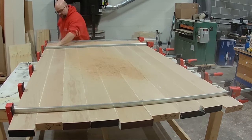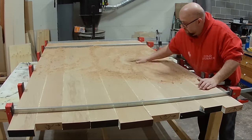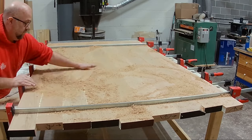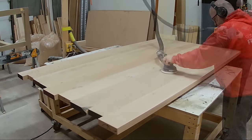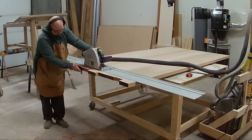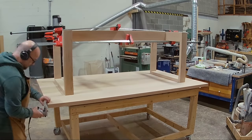After gluing it up, spreading out the glue, and clamping it, I take sawdust from my dust collector bin and spread it over the tabletop. That helps with cleanup of excess glue squeeze-out, and the fine dust particles work their way into any possible gaps or voids when the clamps squeeze the tabletop together. After sanding, I trim off the edge with the track saw — you could certainly use a circular saw, but I have a track saw and it makes quick work of it.